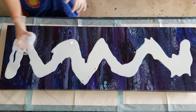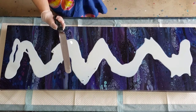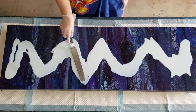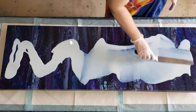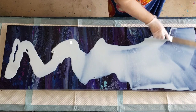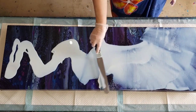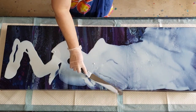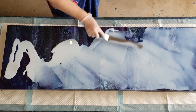I'm not sure how much I'm going to need, but I'd rather do two or three thin coats than thick coats. So there's 250 grams of mixed varnish — 200 of varnish and 50 of water. I'll just pour that out. Then I've got my big cake decorating icing-type tool to spread that over and give a nice even coating first, and then we'll start tilting the excess off. As you can see it goes on white but it will dry clear and lovely and glossy.